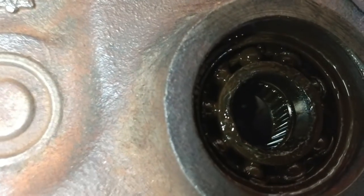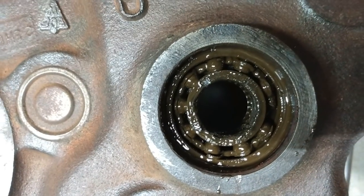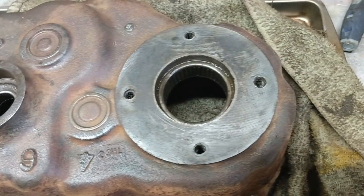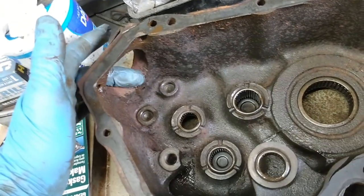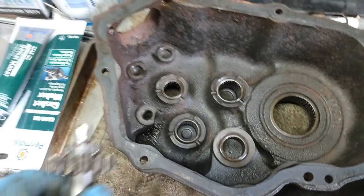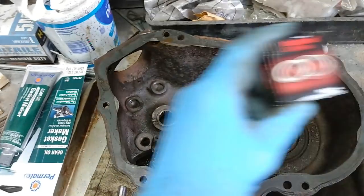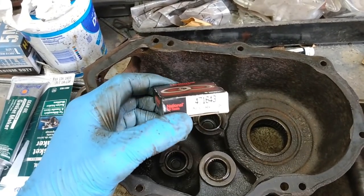There are needle bearings on down inside there and upon initial inspection they seem pretty good. I think all of the pressure was on the outer bearing and it just gave way after years. Got the bearing and the seal out — that inner needle bearing looks good. Cleaned everything out and got most of the rust out. I've got the shaft cleaned up, a new roller bearing from McMaster-Carr that looks like it's going to fit, and a new seal from CarQuest locally — they matched the seal up. There's the part number on it if you need that.